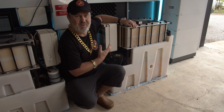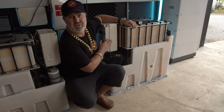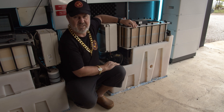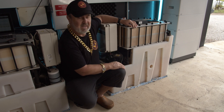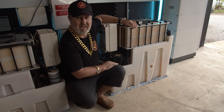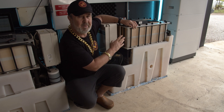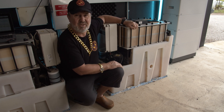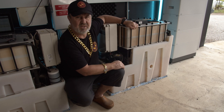This is the control unit for the battery. There are DC contactors inside, which you hear clicking on and off occasionally as they go into strip mode or something else. There are also a couple of fans at either end which vent bromine gas if it starts to build up inside, or manage heat. Bromine has quite a low boiling point — around 56 degrees Celsius — so thermal management is important.